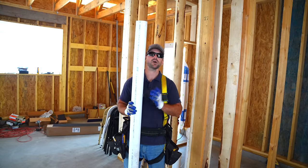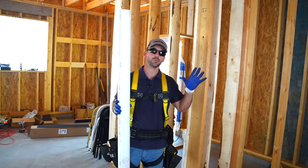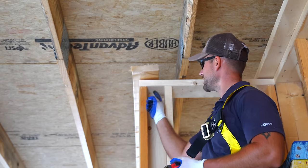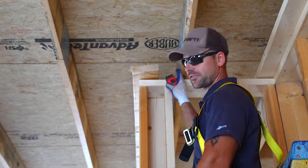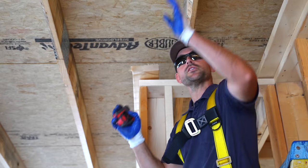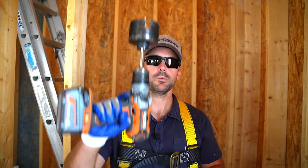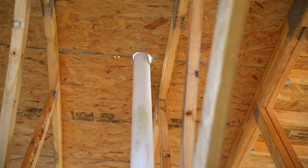That all glued together nicely. I'm now going to install this three inch pipe going up through the roof — I was in the middle of doing my shingles so I have my safety harness on. The pipe is right here going through this wall, so I'm going to follow it until I get past the floor up here, then go right up through the roof. The center of the wall is four and three quarters inches off the edge of this truss — which is actually a floor joist as part of the truss because there's a floor above. To drill the hole for the vent pipe, I'm using a three and a half inch drill bit, going straight up through the sheathing, keeping the drill nice and plumb. The pipe is now stubbed up through the roof, sitting on a wooden block to hold it until we run the rest of the plumbing.